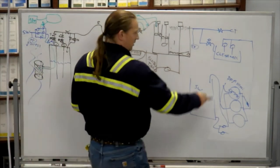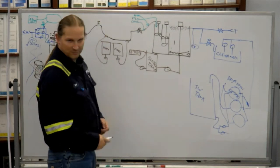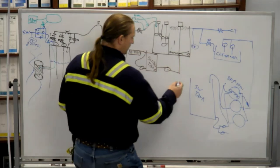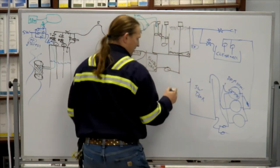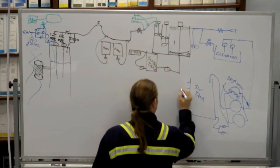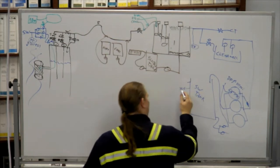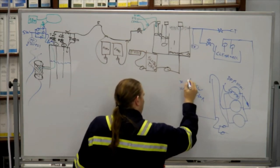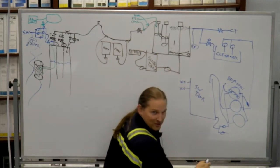All right, what makes the clear well pumps start and stop? Service water tank level. That is correct, service water tank level. You know the range? It kicks on at 35.8, and when's it kick off? 36.8. 36.5, I don't know why you think it's 0.3 higher on both of them than I do.